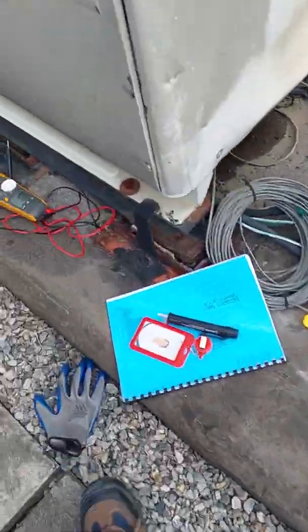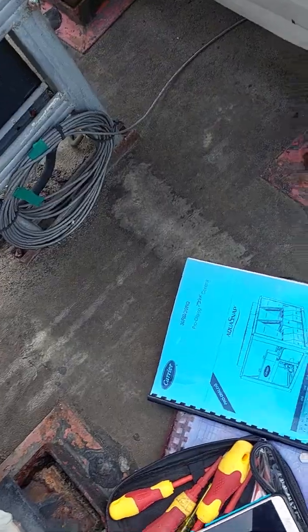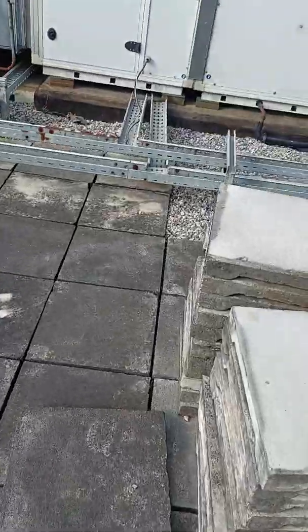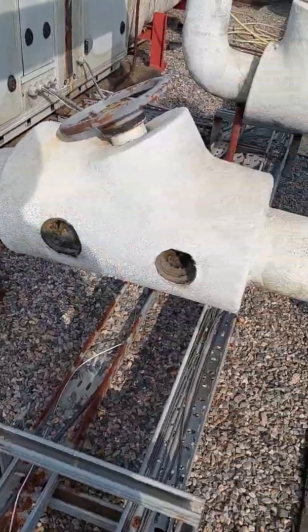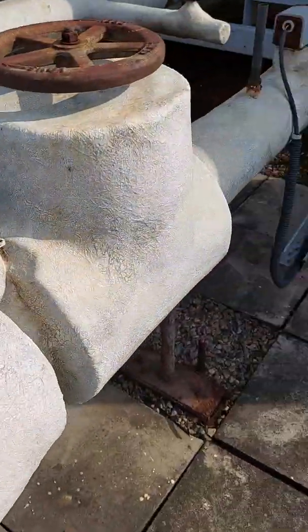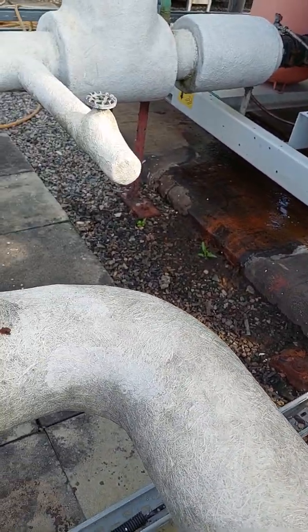This is the code and we have the schematic diagram here. This is the schematic diagram of the unit. You need to read the manual so that you have a better understanding during troubleshooting. Although you already have some understanding of what is going on, please still refer to your manual. Hopefully this video can help. We have a lot of beginners and people who do troubleshooting. You need to understand also that you need to check the gauge if there is enough water — it might be that you don't have enough water and you're still running the pump. It can damage your evaporator.